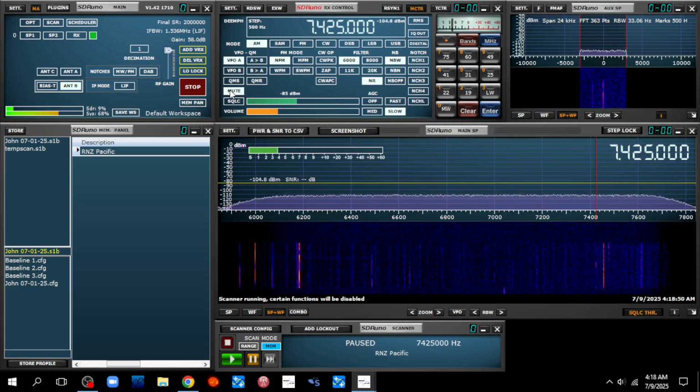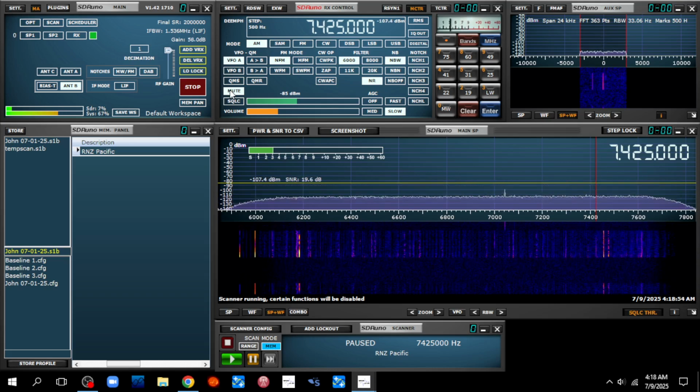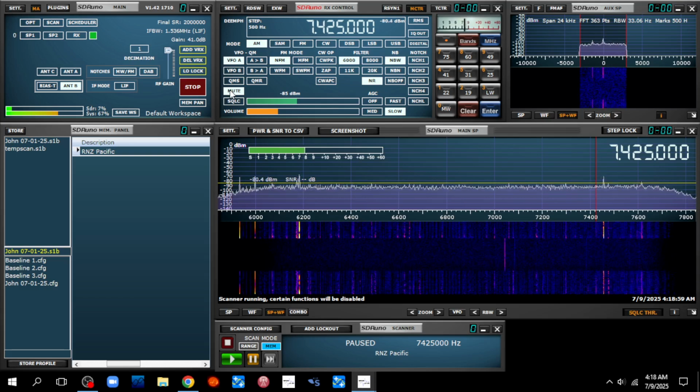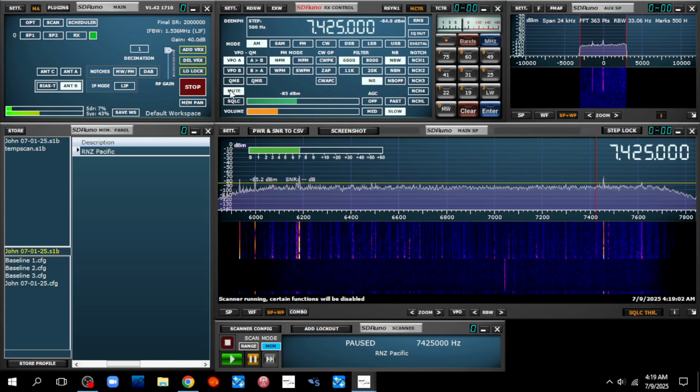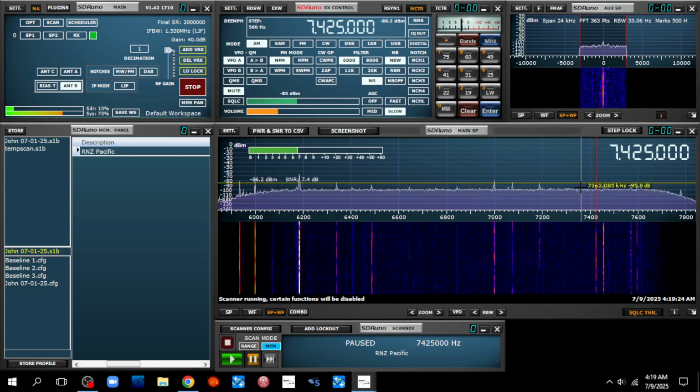That's UHF, nothing there. I think that's medium wave. And then that might mean medium wave. And that is HF. So you see, got a lot of noise there. See all this background noise? Now let me switch back to the MLA, and see this noise level goes down, and the signals are higher than the noise now.